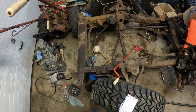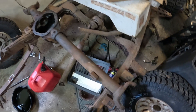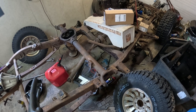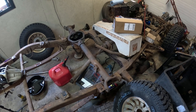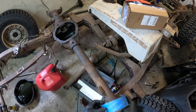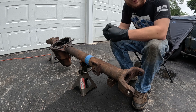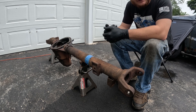I think we're good to start cutting — we only need to cut the long tube side. We do have a little leeway; there's a bit of offset on this tube and you could be an eighth of an inch too far in or out and it wouldn't be a big deal. But we're still going to try to keep things exact, especially because I don't have a big chop saw or bandsaw. I do have the old tape trick — just going to lay out a ring of painter's tape. Here's our mark for 53 inches. I'm going to be on the safe side and stick out if anything. I won't lie, I'm pretty nervous. There's no going back from here, but there's no going forward unless I do it.